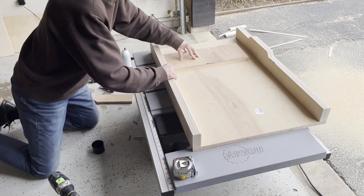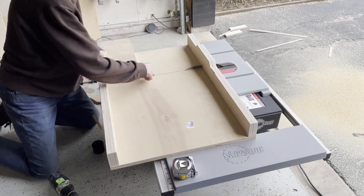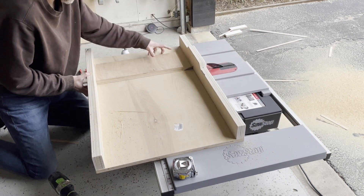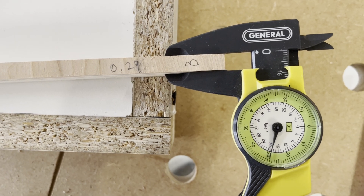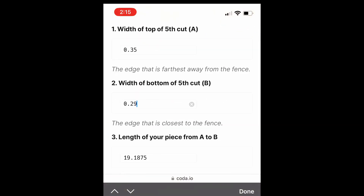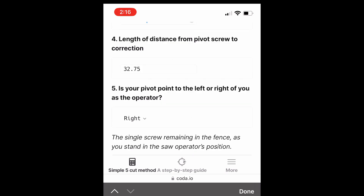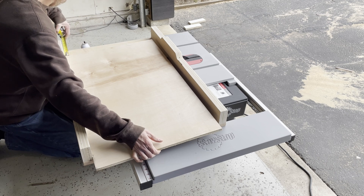Here's where I'm actually doing the five-cut method. I've got a board and I'm cutting all four sides with the sled as-is — you're exaggerating any imperfections because you're doing it four times. Each time you cut, you use that as a reference, so if it's off a little bit it gets exaggerated. On the fourth cut I slide over and make a slightly wider cut so I can measure at the top and bottom. Using my calipers: 0.29 on one side, 0.35 on the other — so 0.06 off, not too bad but needs fixing. Mark A as closer to you and B as further away. I found a website — link in the description — where you enter the A and B distances, the piece length, and the fence width, and it tells you the offset and direction. I had 0.0259, so I used a feeler gauge like an automotive one for spark plugs to fix it and make it all square.